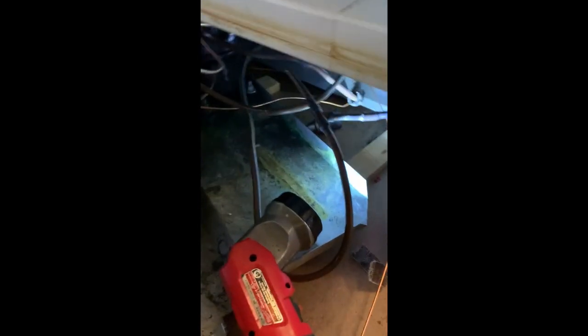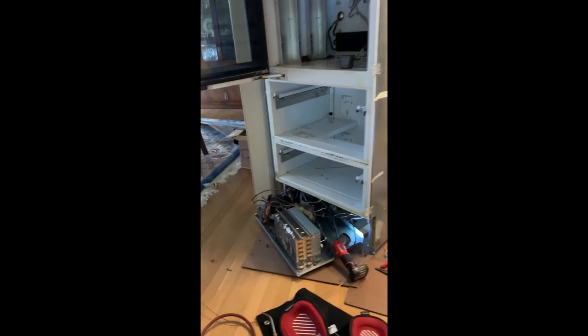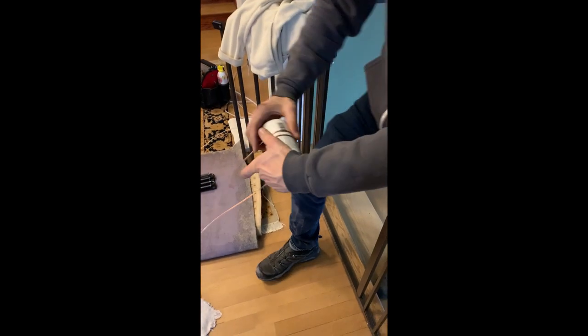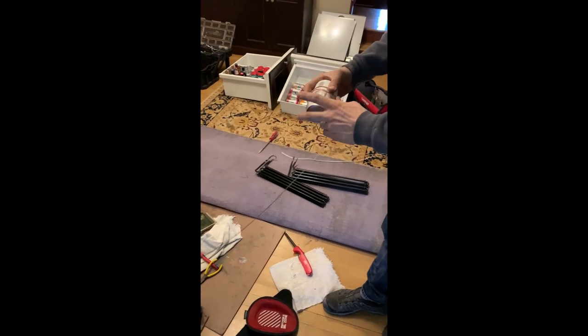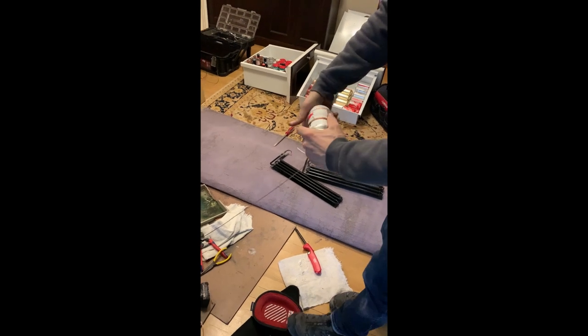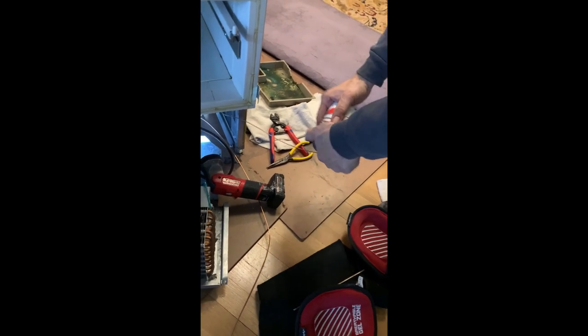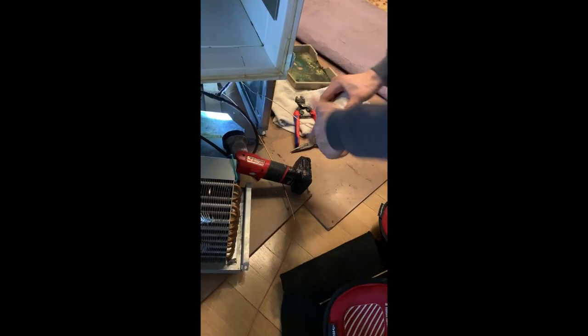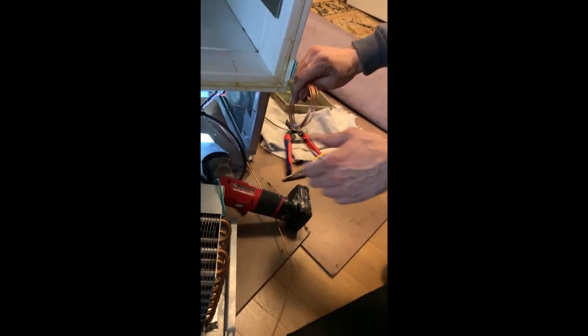We're getting to soldering our new heat exchangers in place into our T. Once we do so, we are going to wrap the capillaries — a beer can is a good size for this. It keeps these long capillary tubes in nice shape, out of the way, in a nice circular pattern. We'll zip tie them together. There you go — a nice capillary run — and we'll run that right into the filter valves.